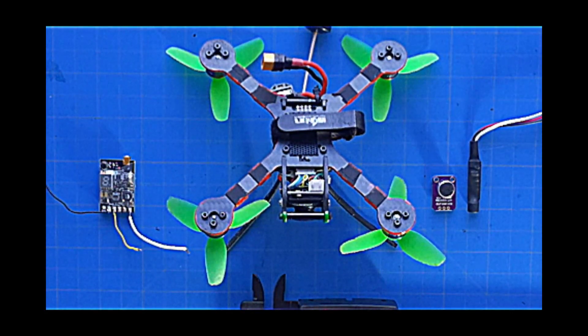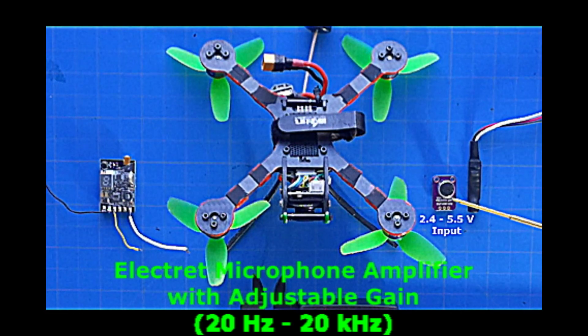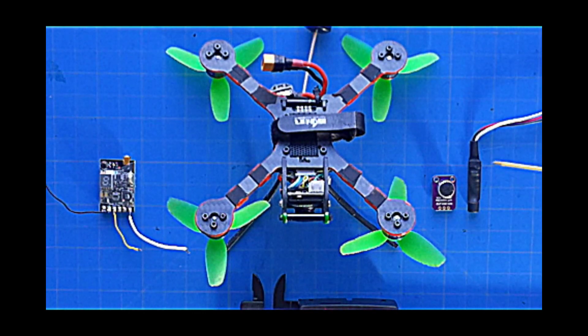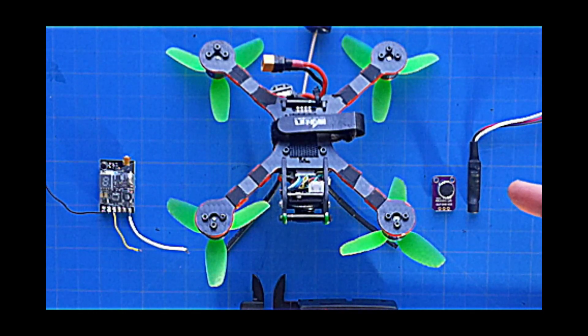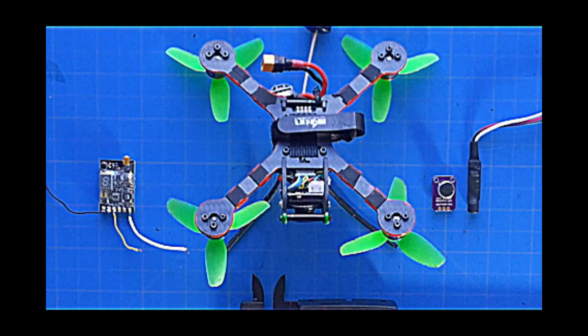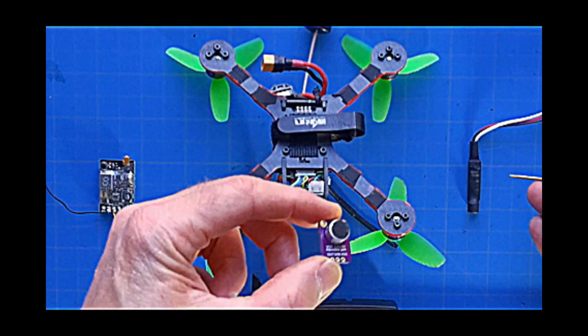The third option, if you don't have a VTX with a microphone or a camera with a microphone, is an external microphone. I've got two shown here. This one is what's called an Electret microphone, and this one is another external mic you can get from Banggood — product links are in the video description below. Usually you'll get better audio quality from an external microphone since that's the only job it was designed to do. If you're using a camera with a microphone or an external microphone, you're going to need a VTX with an audio input connection, either through a plug or a solder pad. For this video, we're going to be using this Electret microphone, which is smaller than the other one from Banggood.